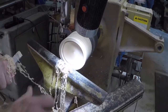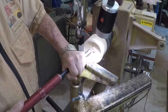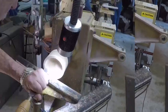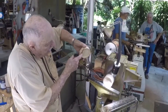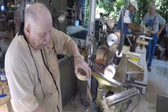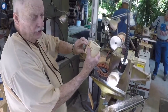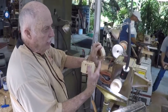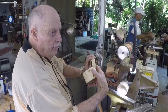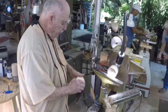Looks like maple? This is maple, yeah. I'm going to take a little bit more off this box lid out here. We want to tuck this away just ever so slightly so that when it hits the box, it's hitting only on the outside part of the lid, not back up in here. So you can see there's a slight taper going back to the inside.